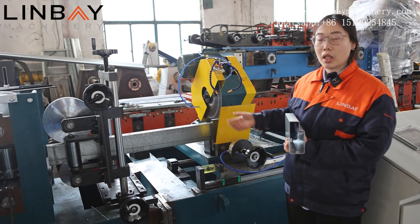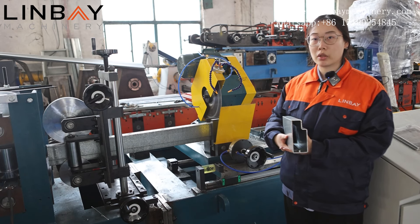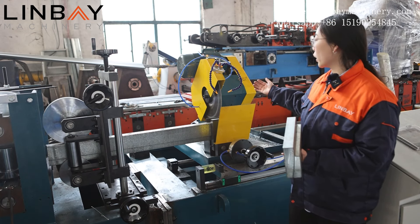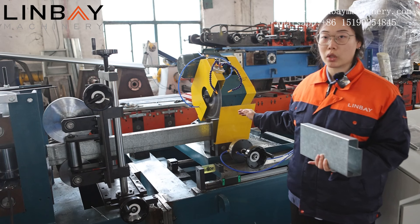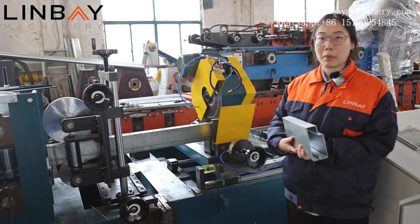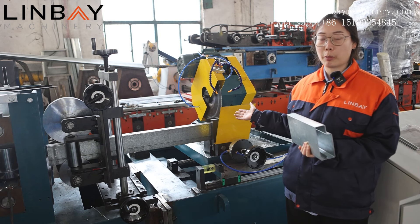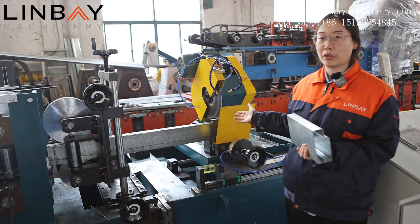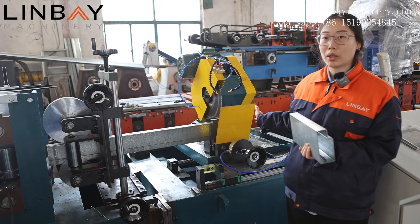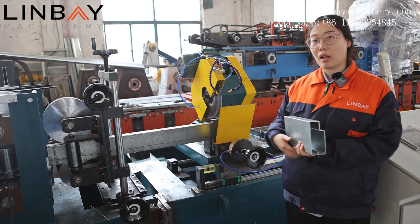Then this is the cutting part. Because the steel beam has a closed shape, we use saw cutting to cut on the edge to prevent deformation. We use a cooling system to cool down the temperature on the blade for higher efficiency. The saw cut means no material wastage per cutting. To improve the production speed, we use a moving function — the cutting machine can move forward and backward, so the roll forming machine doesn't need to stop when cutting.